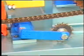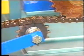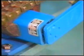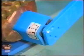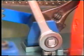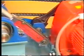The procedure begins as we rotate the main housing, this bringing the jockey wheel into mesh with the chain. We must next observe the angle scale in relation to the arrow here on the arm. Now, by turning the housing, align the arrow to approximately 15 degrees initially. Secure the center screw, then torque it to the specified amount.